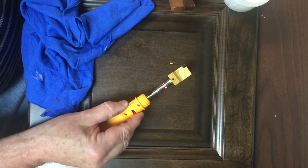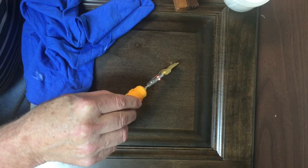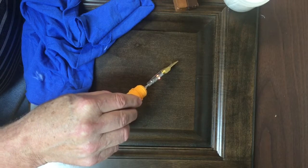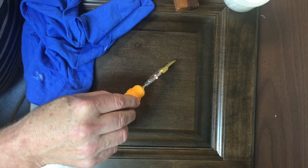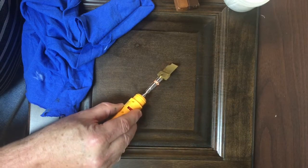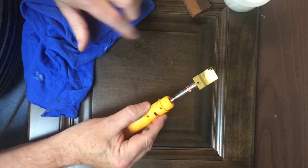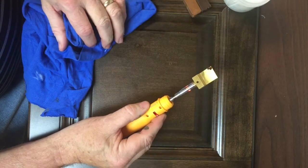I'm going to put a little bit of material on the end of the knife and drip it into the defect — just let it run off the tip of the knife down into the defect. I want to make sure I don't get any bubbles in the material. Once I have that filled, it's going to cool pretty rapidly and it should be slightly above the surface.